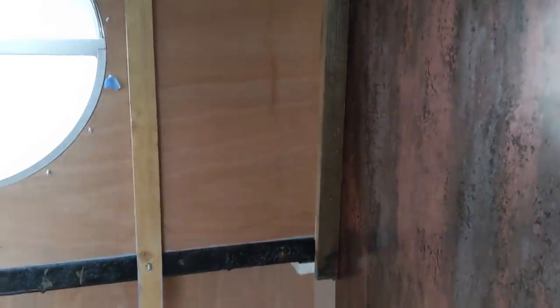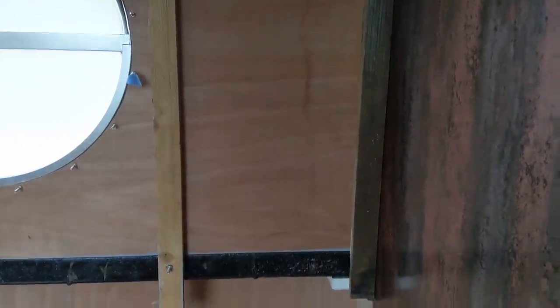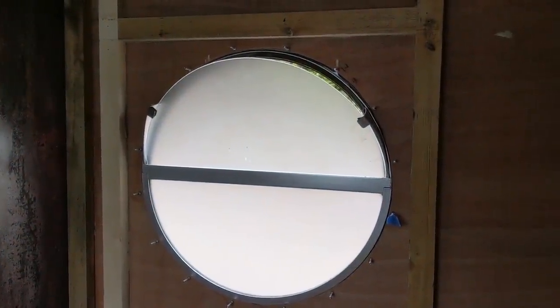While the CT1 sets up we're going to start measuring up and cutting the boards that are going to go over the front of there. We're going to use plywood, and then obviously stain and finish it so that it matches everything else, giving a good mounting surface for the actual shower. Not using the wet wall partly because I've never managed to cut a circle in it for that window. With the plywood we're going to do each side and the top and the bottom, and then I'm going to make a feature around that window.